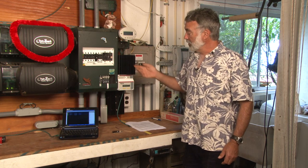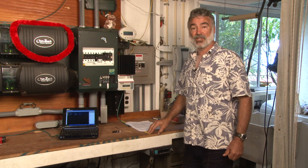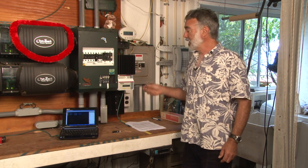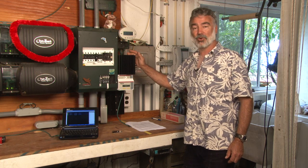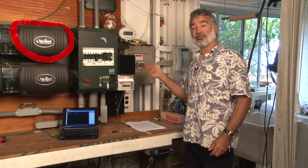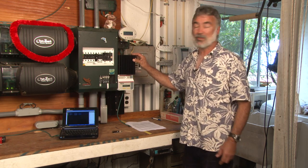A couple of reasons for this: though this has been a very good controller during our comparative testing for the last several years, I'm going to be upgrading this power system. This is only a 60-amp controller, whereas the Midnight Solar Classic Light is good for 94 amps — that's half again as much controller for about the same money.